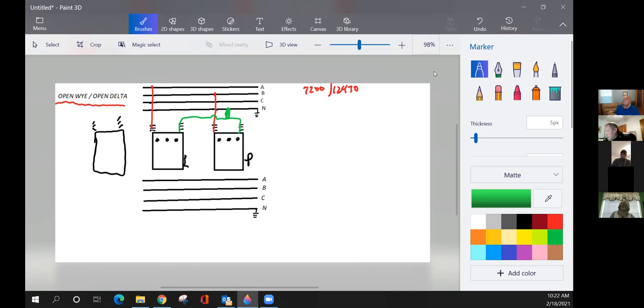Okay. We'll move down on our secondary side. I'm going to connect my neutral first. So he gets done connecting this transformer. I want you to tell me if this is the lighting transformer, or you already got it written there. Yeah, you mean to get lighting and power transformer. So a hard rule here is the lighting transformer always is on the left hand side. We're going to connect that one to A phase. Connect that to B phase, guys.